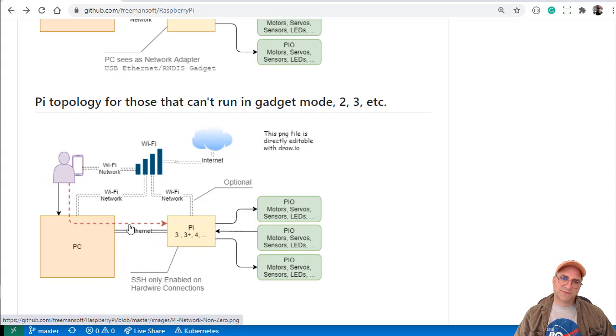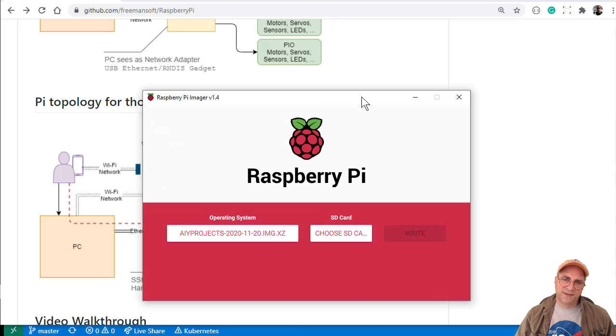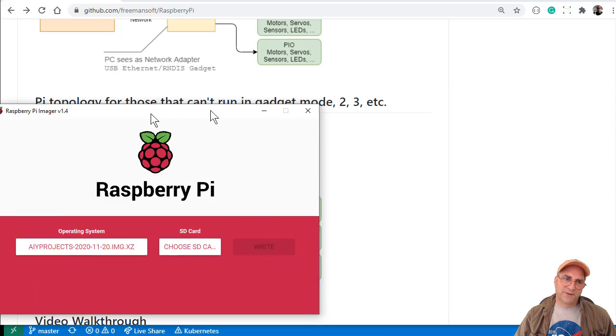Because I like this wired config so much, I decided to make the firewall wide open on the Ethernet connection — which is probably not great — and the Wi-Fi is still locked down. So even though this thing's on my Wi-Fi network, anybody on Wi-Fi wouldn't have SSH access to the device. I downloaded my Google AIY project and used the Raspberry Pi imager for that.